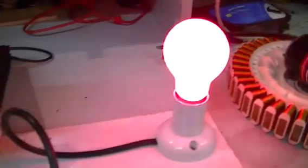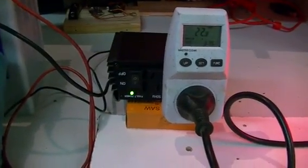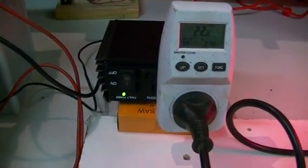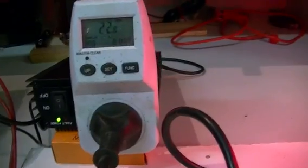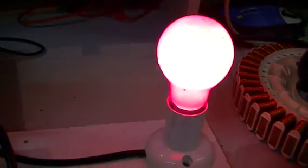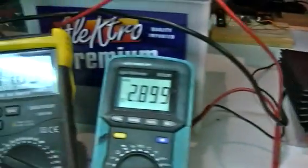So that'll be at the end of this series of videos to come. But first we're going to carry on and do our inverter test, and I'm going to throw the scope across that inverter and have a look at the waveform as well — it looks like it might be fairly clean, because our rated output in watts is very equal to what that globe should be at these voltages.